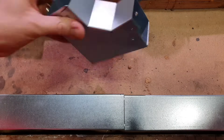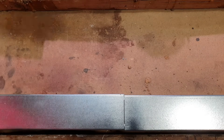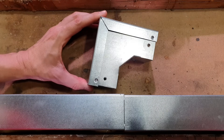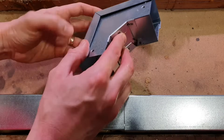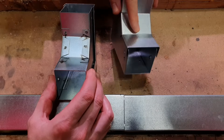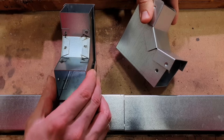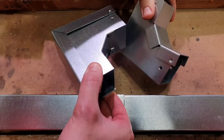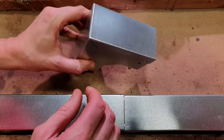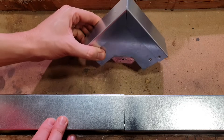Just when you thought we were done with 90-degree bends, we're not quite finished yet — we've got another one. I would call that an external 90. Looking at it compared to the last one — on the internal 90 the lid was on the inside of the bend, whereas on this one the lid is actually on the outside, and that is why we'd call this an external 90-degree bend. However, this is called an outside lid bend according to the manufacturer.